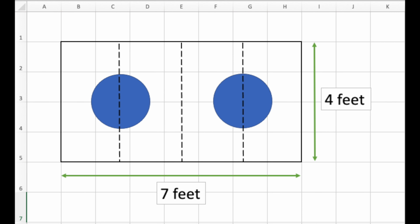Now, what are some easy ways to do this? What you can do if you are going for those 2 pendant lights is you can measure off your countertop, divide it into 4 sections, and then the center of those pendants will go over that kind of 1 and 3 lines. So if you have your entire countertop divided into 4 sections, that's going to give you 3 different lines. Now from there, again, you'll have the one down the center, and then you can use the other 2 lines to really pinpoint the center of where that pendant light could rest. And then you would just make sure that, again, it has enough room on either side and that you do have some spacing in between.